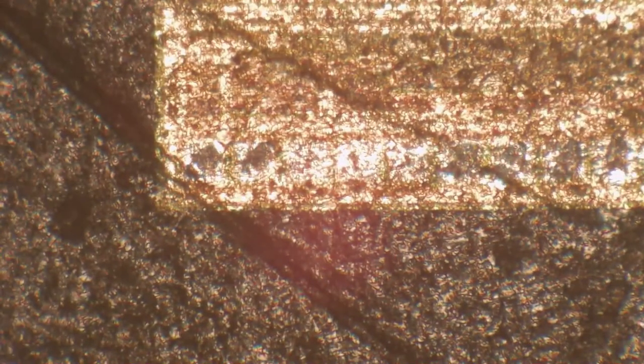Let's see where we're at. I can clearly see that there is still epoxy over the microcontroller, so we're not there yet. But we can definitely see some structure here. What I think we're seeing right here is a bond wire. Yep. You can see that big shiny mess. If you notice, it's in focus when everything else is out of focus. That's one of the bond wires that's been ground away. And you can see as we focus down in through the epoxy and then we get the chip itself into focus, that's a bond pad. That's one of the pads where one of the wires is connected.